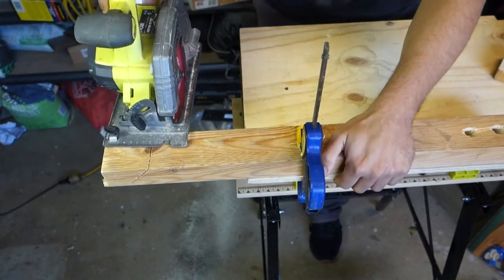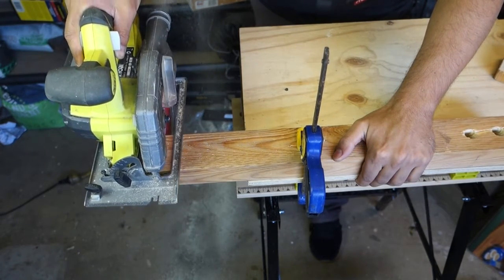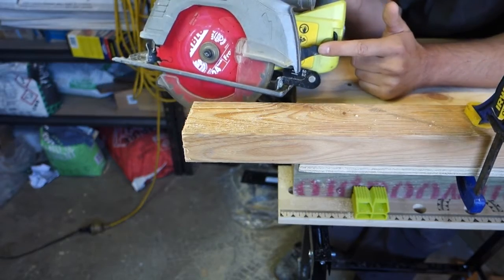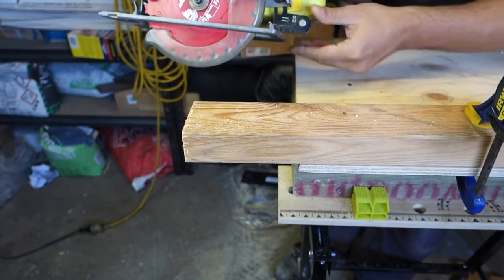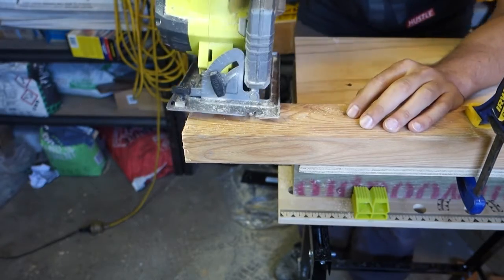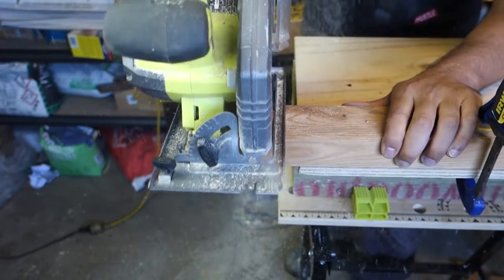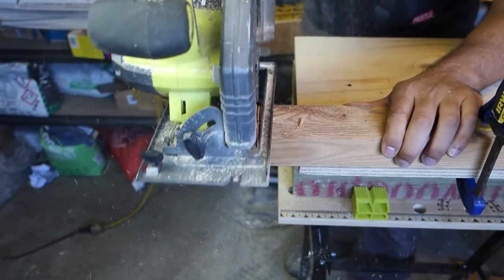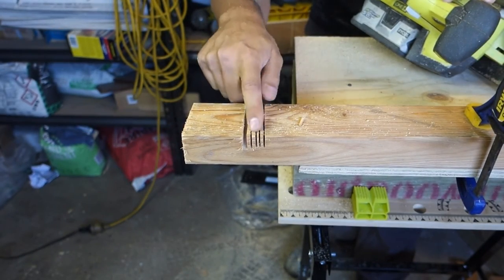So once again, another clean cut on this one here at 0 degrees with the bigger size timber. And you can see once again another clean cut. So to use a depth gauge on this is very easy. If we wanted to notch out a section on this timber, we can use a depth gauge to do this. Pop the lever up, put it to the desired adjustment. So we've got here set on 20 mil. And then what we can do is just simply run that through. And then we can easily notch that section out and just remove it with the chisel.